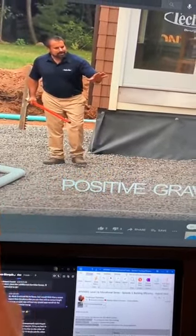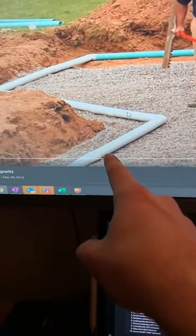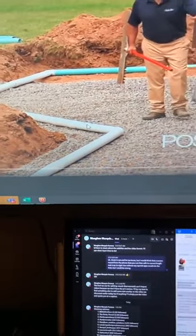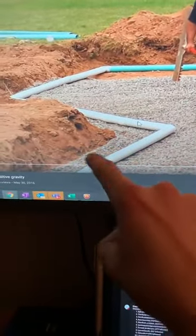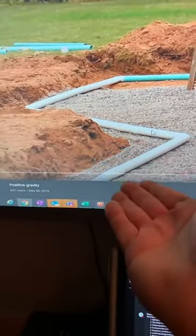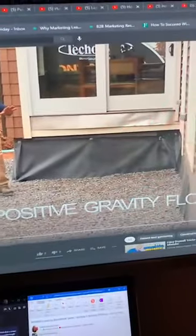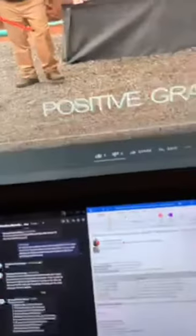That water goes over here, and this is where our pipe is. So here you can see that Schedule 40 pipe with the holes down. So the water would follow the membrane, get to this area, and whatever doesn't soak into the soil here would build up and go into the pipe. So yeah, you do want to put that liner in. It's another argument for why we shouldn't be building up against the foundation wall of the house, though.